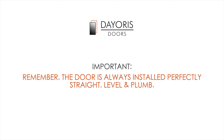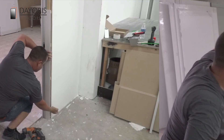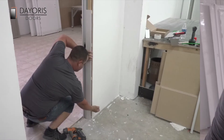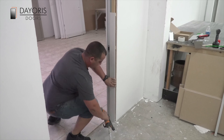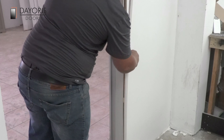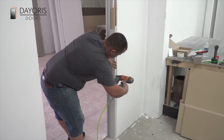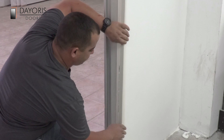Flush to the wall, rear inset side. The 2x4 buck needs to be shimmed out enough to give a base for a sheetrock presentation jam. On the rear of the aluminium frame, place a piece of sheetrock into the pocket found on the back of the frame. The sheetrock piece should extend out perpendicular from the frame, terminating at the sheetrock lined flush on the back or inset side of the flush door. Using a piece of corner bead, form a 90 degree angle between the sheetrock presentation jam and the flush side of the wall.